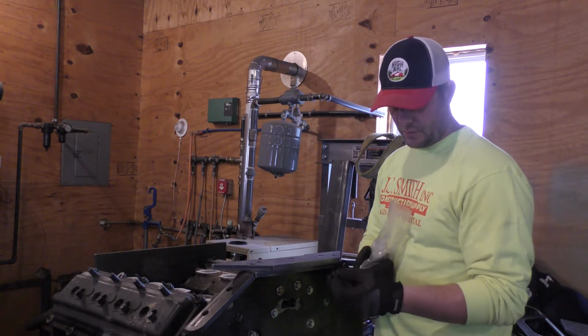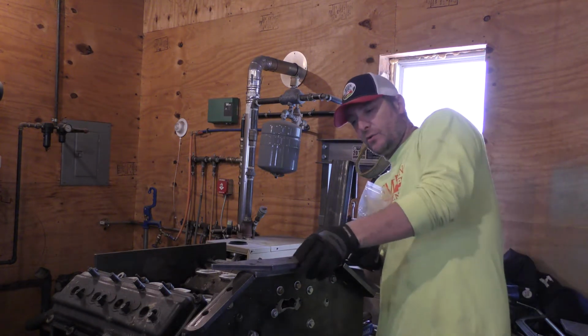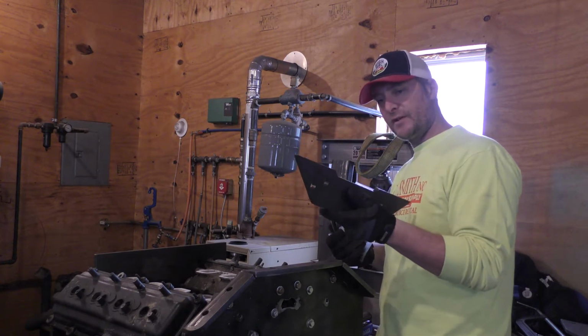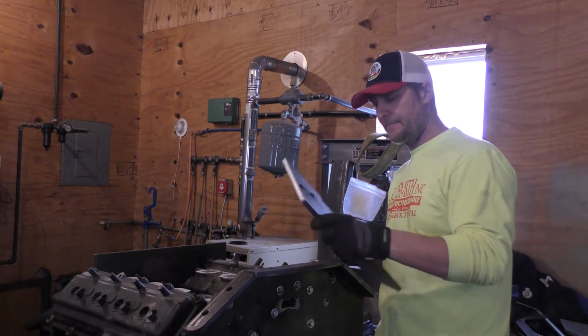They'll come through this plate I have here and through the front plate, and then here's my new lower pulley protector piece. If you remember right, I made this template in the last video. It'll come right through this, it'll bolt this up, and then I'll weld my bottom piece to that and the front piece onto the pulley protector.